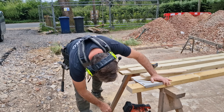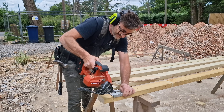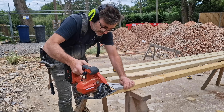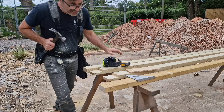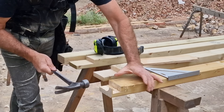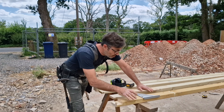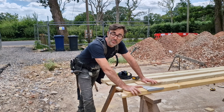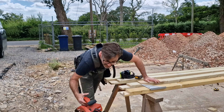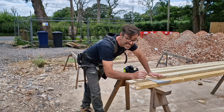This is what I don't do — a lot of people do all these multiple repeat cuts, and you can see it just creates loads of mess all over the site and then you've got a lot more chiseling to do. We stick to the way I do it — it's just a lot quicker and easier. Practice, and clamp your work down as well. This is something to be super careful of and you need to be really quite handy with a well-balanced circular saw. That's how my halvings are done.